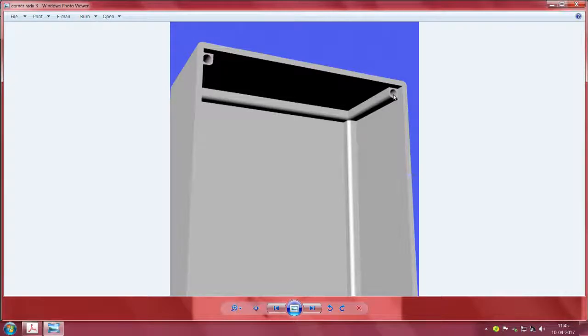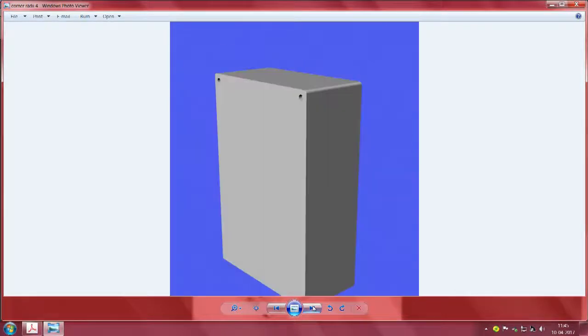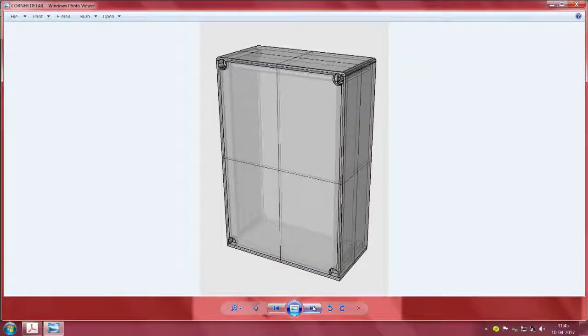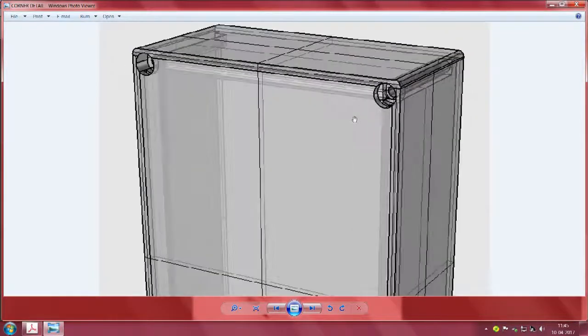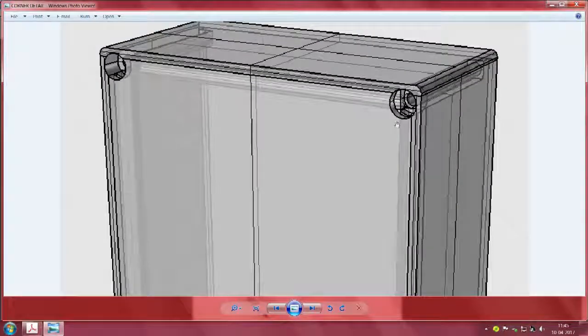And to get over the problem of this being a soft material, and then it may not be amenable to threads being cut in it, which is called tapping, you can even put a steel insert into it. That steel insert will have threads which are made out of harder material. So we have this object. Now you see here the completed object. Now it's more convenient for us.